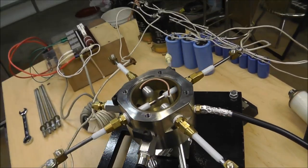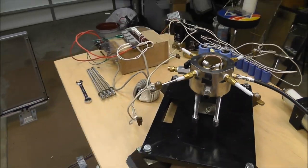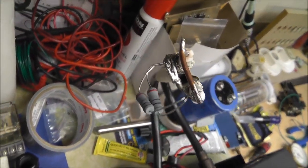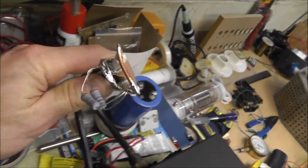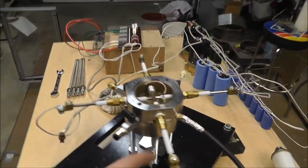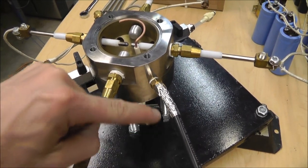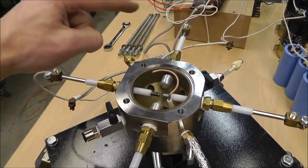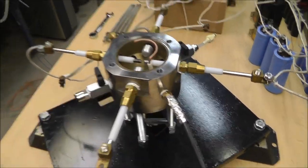It doesn't have the power potential across it. So there's no real reaction going on inside the chamber, in my opinion. So that's what I've got. I've got a dummy load, and it looks just like that. But my problem is I wonder if I need to take the ground off here and put my dummy load right here so that this is fully energized and then has to short out through the whole entire unit back to the RF ground.